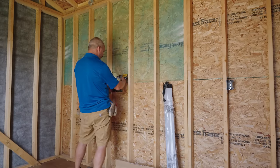Okay, so I'm shoving my wires in. I'm pulling forward, creates a bend. Lift it up and push, and it curls right out. Okay, stick it in halfway. Pull my white and my black up, put my ground wire around the screw.